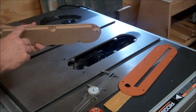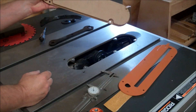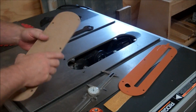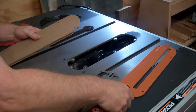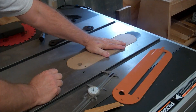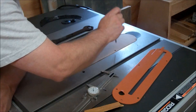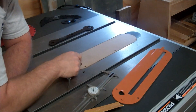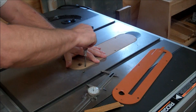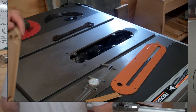Or once I cut this out of some hardwood, maybe I can put a screw in there that will keep it nice and snug. I got the finger hole basically in the same place. And I do want to mention for all you YouTube safety patrol people — I unplugged this before I took the blade out, so I just want to make sure I mention that. Anyway, for a test piece out of MDF, the main things I was looking for were: one, to make sure it fit down in there, and two, to make sure these holes lined up with the adjustment screws — and all of them do, perfectly, so you can screw them in or out to adjust. I do need to make that a little deeper as well.